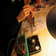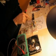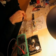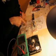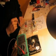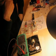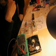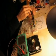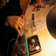Let's turn up the speed some more. By this time, this pulse clock is probably invisible — too fast for you to see how fast it's blinking. But you can still see these three LEDs turn around and around. The same signal is fed through these three wires into this L293 motor driver chip. It has its own power supply and you can see how much current it is drawing on this measuring device. And there you go — the motor starts to, well, jerk around. But the rotor is still turning, and that was the main purpose. Let's see if we can speed it up some more.